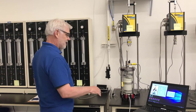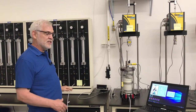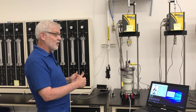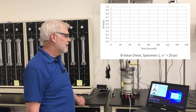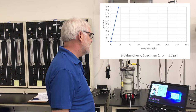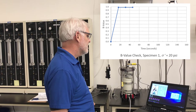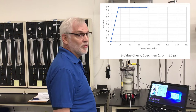So I have my drainage line closed here. I have five extra psi in these. I'm going to open just the cell pressure to put that extra 5 psi outside the specimen. If it's saturated, the pore pressure on the inside will go up by 5 psi. The test has started. Looking at the saturation B-value check — we'll let this run for just about two minutes. Right now it's looking pretty good; it's saying that the B-value is 0.98, so if we stay there we'll be in excellent shape.